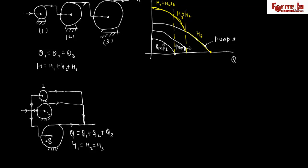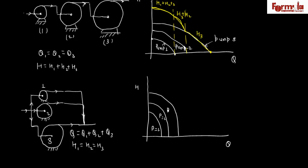Since the pumps are dissimilar, the head developed by the largest pump is greater, and this larger pump will force the two smaller pumps to develop the same head — but this is beyond their capacity. If the pumps run in this arrangement, pump one and pump two will be damaged after some time, and the motors running them will also be damaged. Let's understand the parallel arrangement through a Q-H graph.